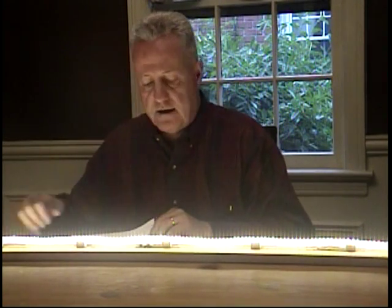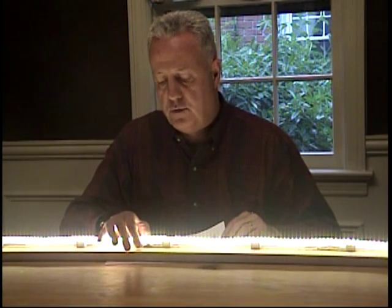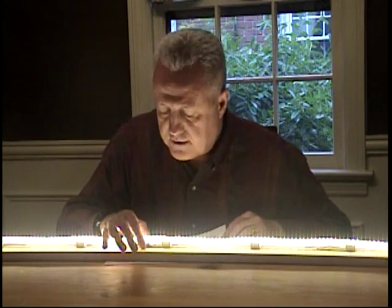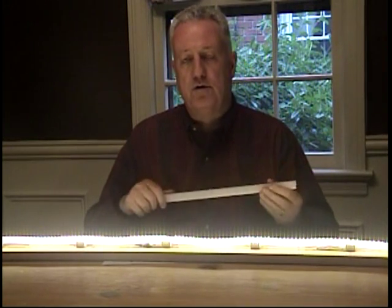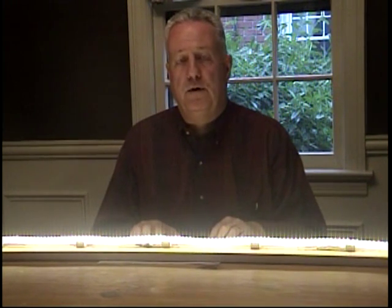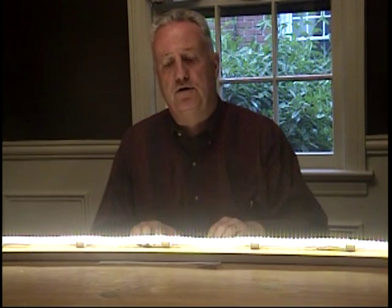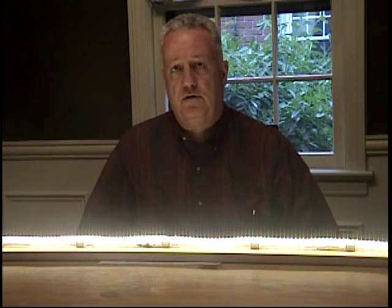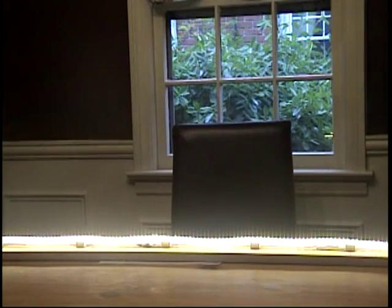Tuck the wires in between right underneath. Take the two different wires — the four, the two outside and the two inside — and the ones on the inside together. Make the one inside a little shorter so that these can tuck right underneath. You can barely see them. We also have the light guide, but that light guide goes on with a different clip. This should help solve the issues of poor wiring within the connection. You shouldn't have any shadowing, you shouldn't have any gap. You should use the gray wire connectors because it's the smallest one and fits very snugly underneath. If you have any questions you can call me at my office at 212-695-7090. Thank you.